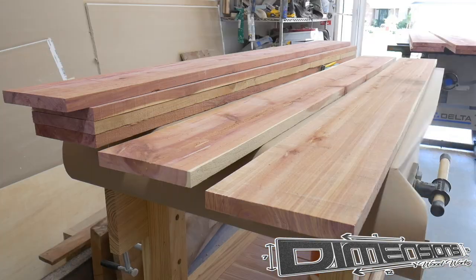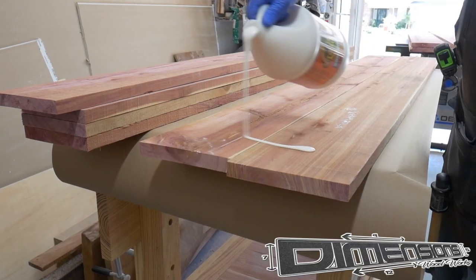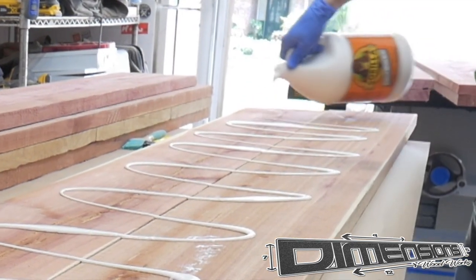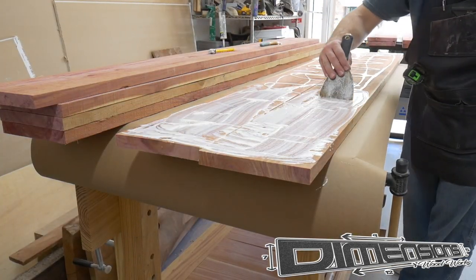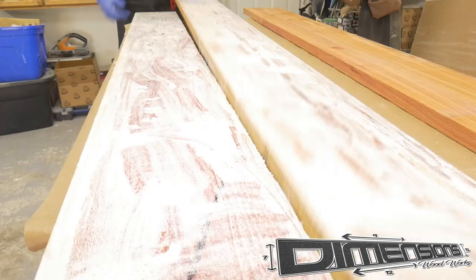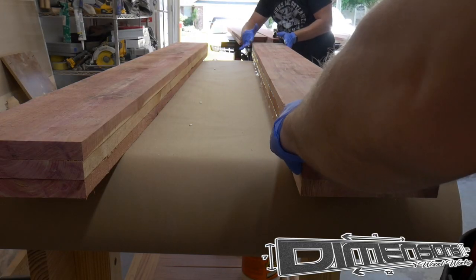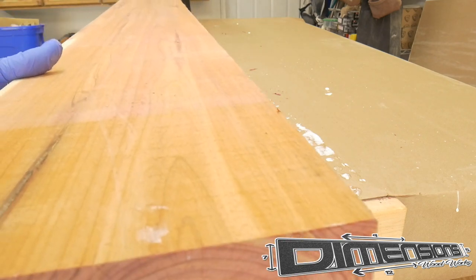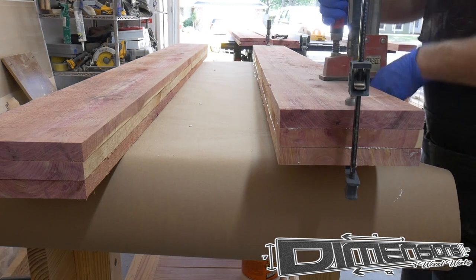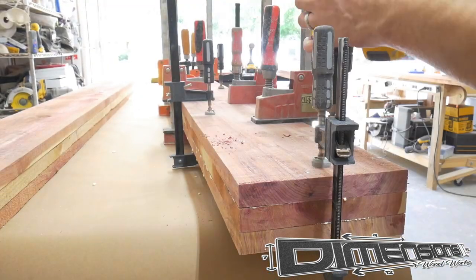Because a few parts in this build called for three inch and two inch thick material, I had to do some laminations because my lumber yard only had four quarter material available. So I just get them cleaned up, put a liberal amount of glue on it, then I stumbled on a little trick in this build by using the sheetrock mud knife, then sprinkle down a little bit of salt to keep it from slipping and sliding too much while in the clamps, and get to gluing the boards together. I could have run the faces of these boards over the joiner, but I didn't want to lose too much thickness in the material, so I just glued them up as they were.